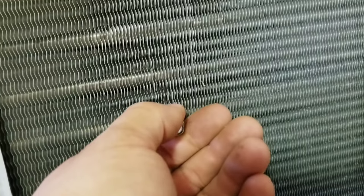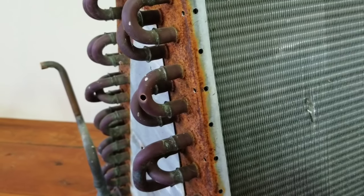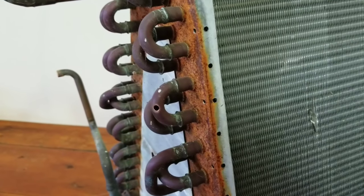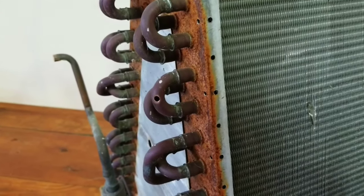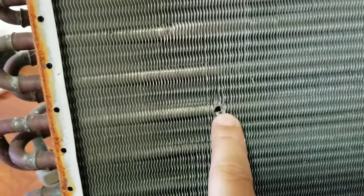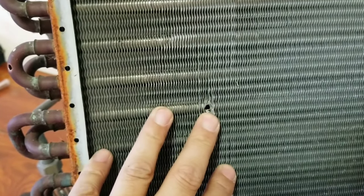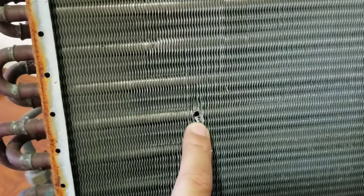I also got one in the fin pack. This one is going to simulate somebody putting panels on and puncturing the tube sheet, which is typically what I've seen on condenser units. When people are putting on panels, they might use a screw that's a little bit too long, or the configuration is different and they don't realize it and accidentally punch a hole in the coil. The fin pack puncture is going to be rare, but on a commercial unit, if something has damaged the coil and the coil costs thousands of dollars to repair, they may want you to try to fix it by removing some of the fin pack around the area that has the hole and attempt to fix it.